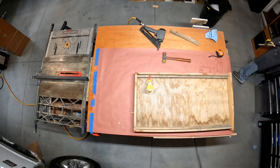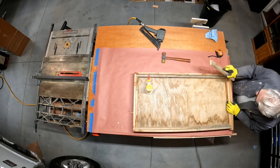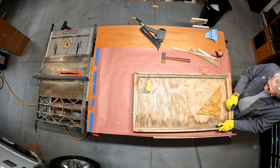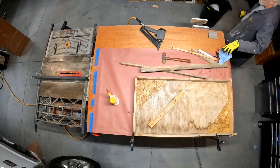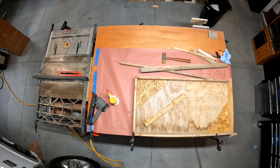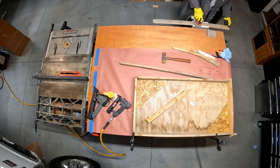So now I'm looking for something to lay under them and hold it up just right for the thickness of the glass, because the glass is just going to lay on top of those, and it'll be silicone in. And I found out that the 7/16 board held it up perfectly, right to the right depth. The first board I used was 1/4 inch. It didn't work.